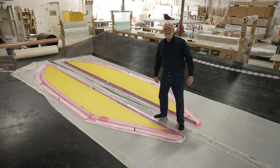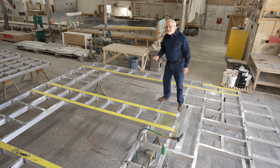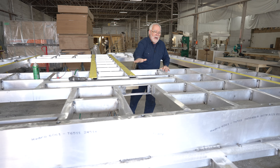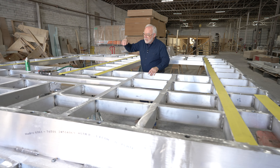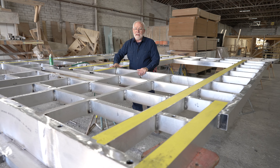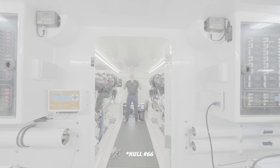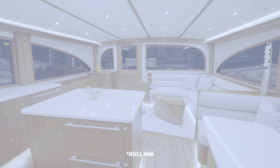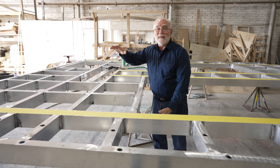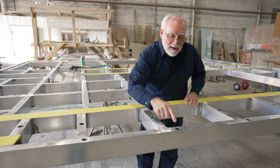Now let's take a look at the salon floor, which is one of the most taken-for-granted components in the boat's construction. The whole floor is made out of aluminum because it's easy to customize — we can make pass-throughs where we need them for running wires, hoses, and pipes. It's very strong and we have the ability to put sound-dampening foam in between. We'll put a bottom plate on it that is a foam-infused pre-painted part so the engine room side will have a nice clean white ceiling. The top side will have sound-dampening plywood — that's what you'll stand on in the salon. The sound difference between the loud engines and the nice salon is tremendous. The holes you see are for spraying foam for sound-dampening purposes in chambers not used as chases — it's sort of like stuffing our turkey.